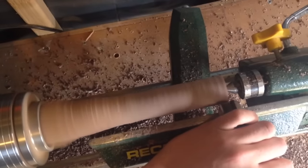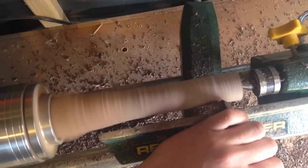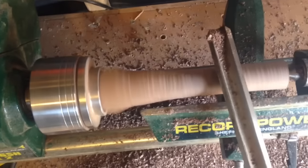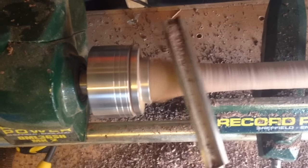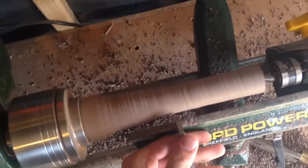I don't know if it's exactly good practice, but I was taught this from a woodwork teacher: when I'm trying to figure out if something's round, I put my chisel on it. If it doesn't bump at all, it means it's nice and smooth. If it starts bumping up and down, that means you're hitting corners and it's still not perfectly round.